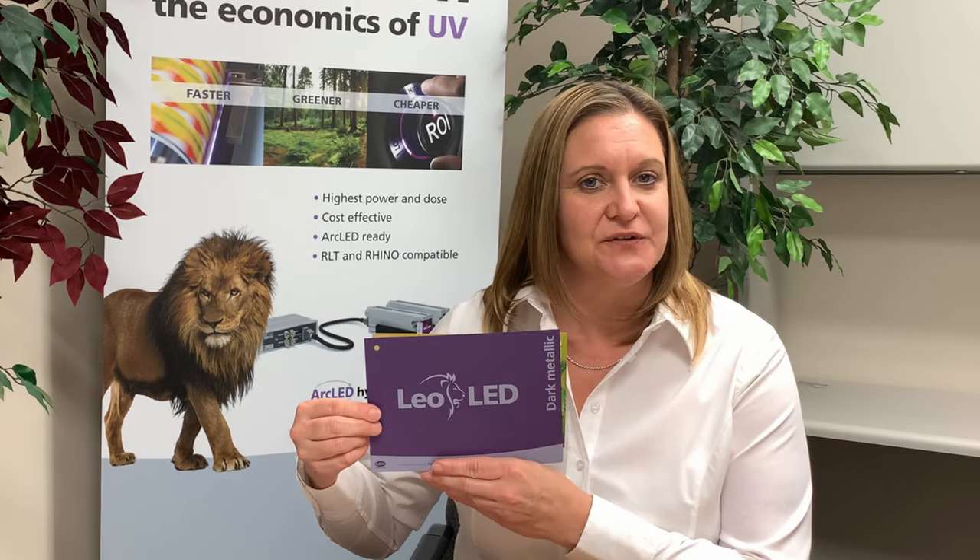The third benefit of LED UV curing is that it immediately expands a commercial printer's product range. UV inks are not easily absorbed into porous substrates such as paper — when inks are absorbed, the color washes out. Instead, UV inks remain on the sheet surface, so color matching is more consistent and colors are more vibrant. This image was printed and dried conventionally on uncoated paper stock, then printed and LED cured — the LED cured image on the left has bolder colors. Because UV curing is a chemical reaction, the inks naturally adhere to a wider range of materials including plastic films, metallic materials, and mirror boards.